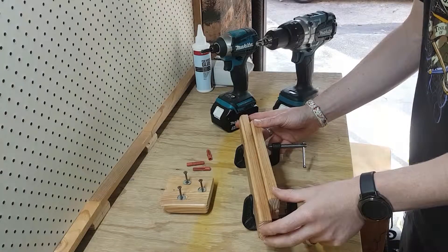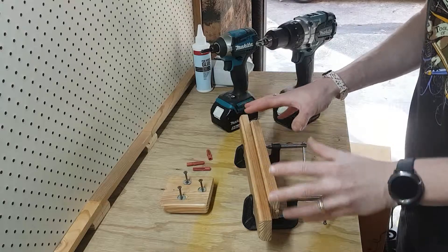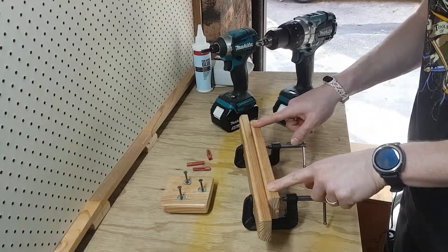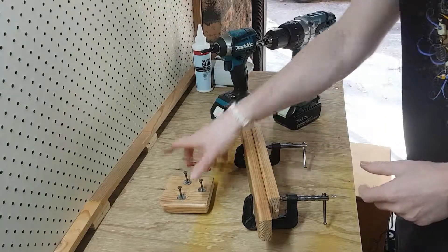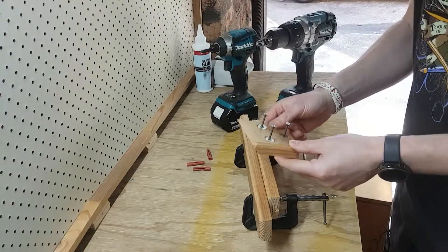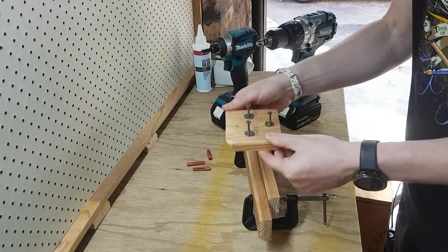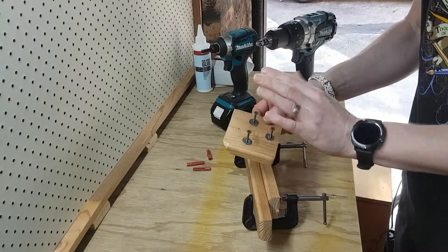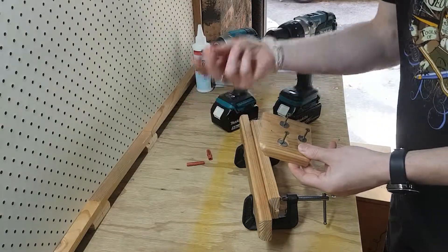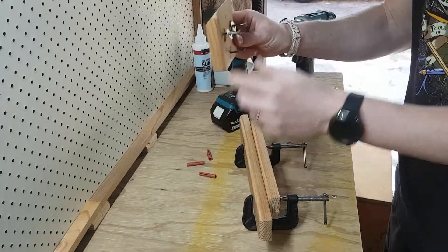Well that's been a jolly bit of fussing about, but it's been good fun — educational, trying a few new things. This is where we've got to with the middle section of the top of the pegboard and, importantly, the hanging mechanism. This bit is going to be stuck to the wall — I've cut my 45-degree bevels there and rounded over these edges. I've got three screws; I just didn't think two was going to be quite enough. Hammer drill into the wall, plug those in, and that sticks on — so that's the hanger.